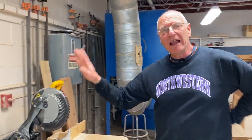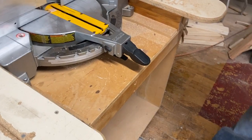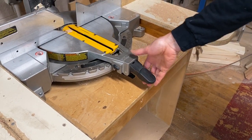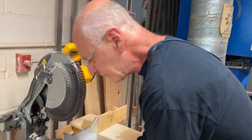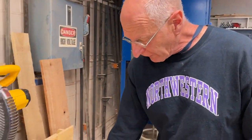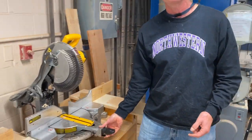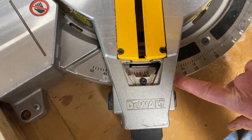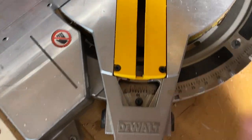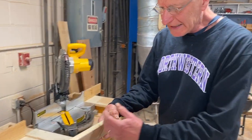I need this at a 45-degree angle. To adjust this miter saw, there's a clamp block on the tip — that black clamp block. If I loosen it up, right now it's set exactly at 90 degrees, or zero depending on how you look at it. I want to move it to 45 degrees. Using a spring-loaded clip on the bottom, I squeeze it up and slide this over to the 45-degree angle. There are positive locks at 10, 15, 22.5, 30, and finally 45 degrees. I push the clamp down and I'm all set to make my cut.